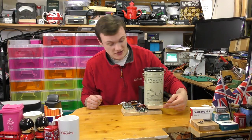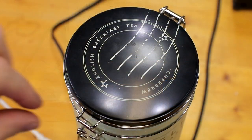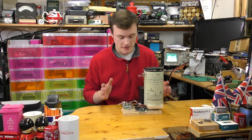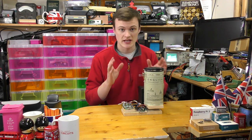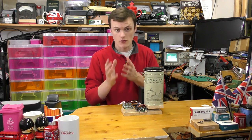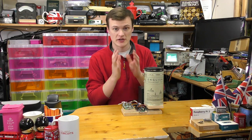Under this wooden pressure plate is the load sensor, used to measure the number of bags inside the pot — though it will only be an estimate because it measures weight, not quantity. When the system boots up, the first thing it does is take a series of readings and average them from the load sensor, so we can get an idea of the variance in the output and use that as hysteresis to ignore results that oscillate between two values.